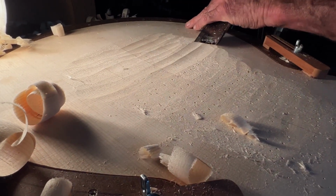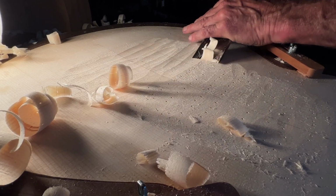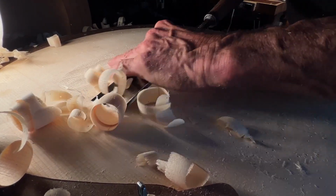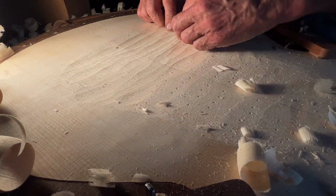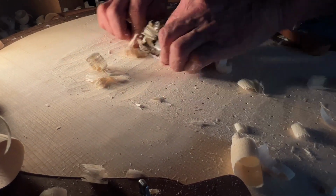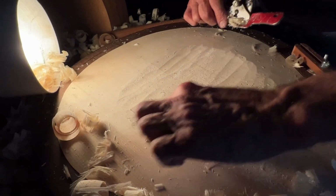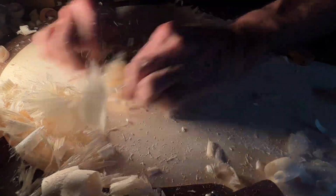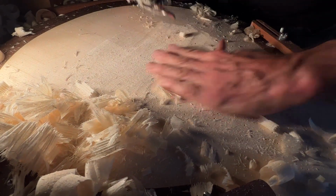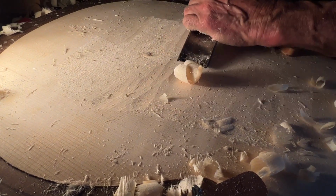And what you have to be careful about is what I just did over here. I erased all the marks, so I didn't pull out as quickly as I had intended to. So that's when you might want to start looking towards the spokeshave, which is a discriminant cutter. In other words, it refers to the surface you already have. And so it makes a continuous cut that is a little easier to control. But you can see it's also not capable of taking a lot of material off, so we're going to go back and rough with a big gouge.